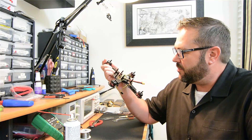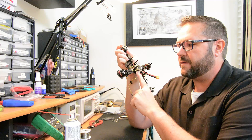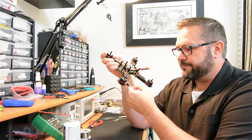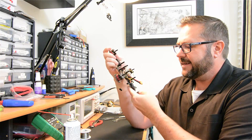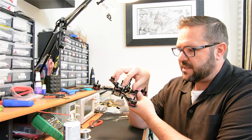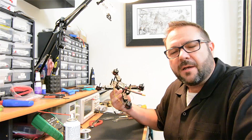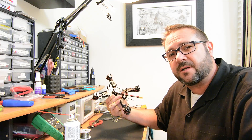That was a lot of — well, not so much a lot as it was a little tedious work. What we have now is the power distribution board set up in the middle of the frame. We've got all four motors mounted with Loctite on the bolts, our ESCs connected to the motors, and our ESCs connected to the power distribution board. All these yellow wires are signal wires which go to the flight controller so it can tell the ESCs how to power the motors. One of the next things I need to do is run continuity tests on all my contacts to make sure I didn't short anything out. After that, I have the flight controller resting on top — I'll start wiring it up, oriented 90 degrees off so I can access the USB port, which is important for firmware updates. Next steps are connecting the ESCs to the flight controller, then looking at how to install the VTX.